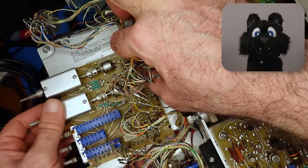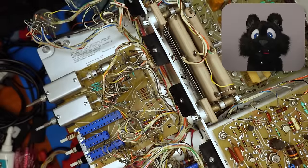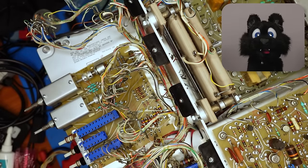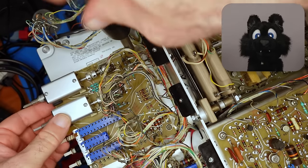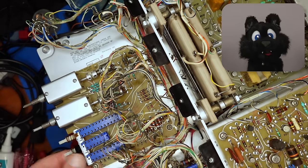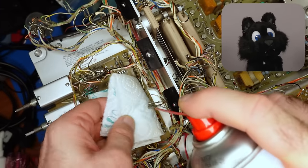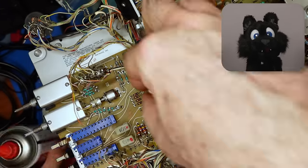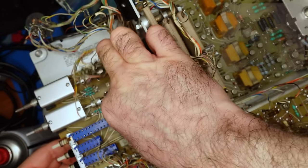Located right next to the display amplifier, separated with the mounting plate, is the display switching board. It has the zero adjustment controls as well as the display invert option. The relays on it can switch the horizontal or vertical signals directly to the test fixture provided signals, overriding the internally created ones.